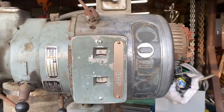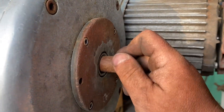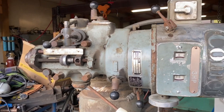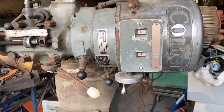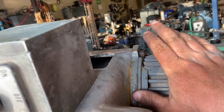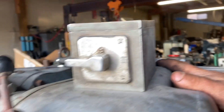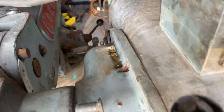That was a to-do, but it's on there - see, it's turning. The draw bar's loose. That's as far as I'm going to film today. I'm going to wire the head tonight and get it wired up. When you mess with these variable speed belts, because the back is spring-tensioned, you just want to bump it a time or two to pull the belt in and engage the spring. I have the spring nut back there set a little loose - I'm just going to bump it a couple times, cinch it down, bump it a couple times, cinch it down.